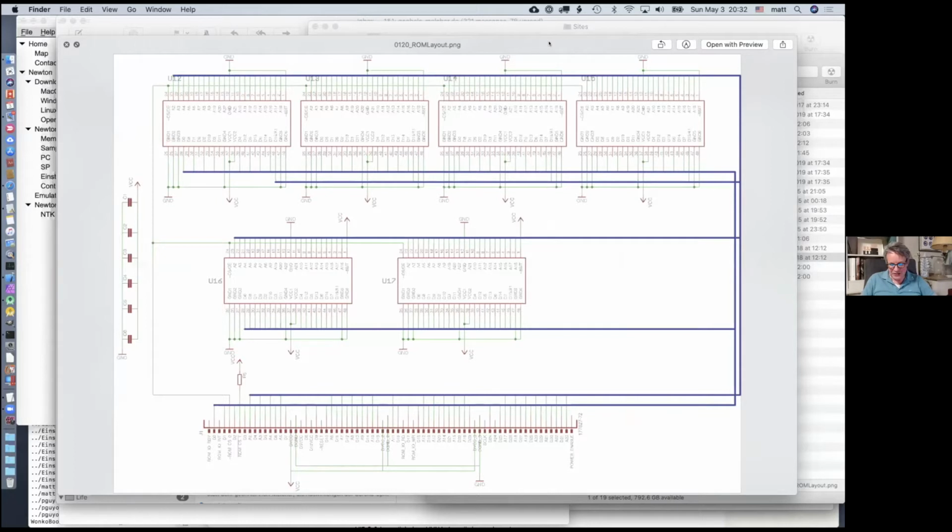And we see in the bottom, that's the connector. And by then I had the pinout of the connector, and U16 and 17 are the original ROM chips, and the 4 chips on top are the unknown pads that were still on the board. So unfortunately, the result of all this was that this is all wired in parallel. So the reason why the ROM board has those free spaces on the bottom is that Apple wasn't sure if they could get masked ROMs that were big enough. So they made space for smaller ROMs on the backside.